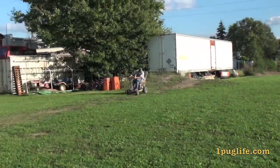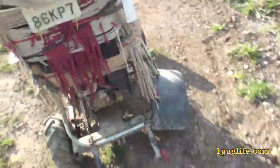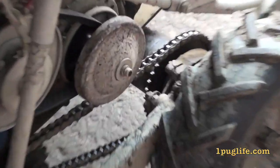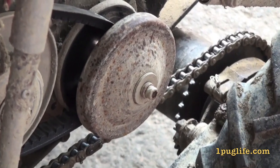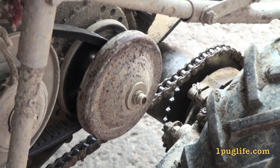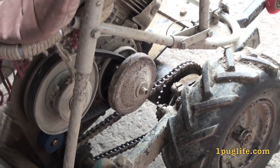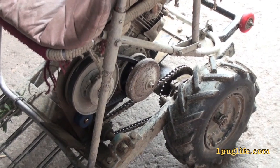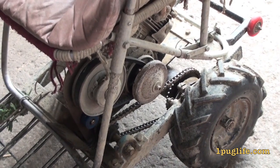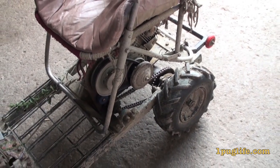Oh, dick. Something's dicked. Hang on, bud. What happened here? Well, frig sakes. Program's just dicked. See that bolt right there in the end of the clutch mechanism? Well, what happens is the whole shaft area heats up, eh? When you put heat on Loctite, it pretty much dissolves it, melts it down like BHO, and that just cocks over the program. So it just keeps loosening and eating off. So I put more Loctite in there, and it's all good until it heats back up again. So that's pretty dicked.